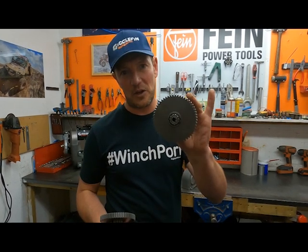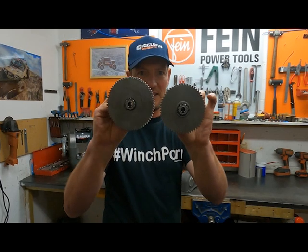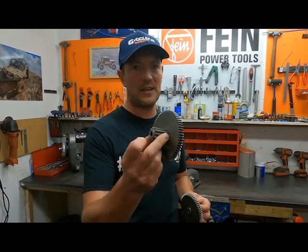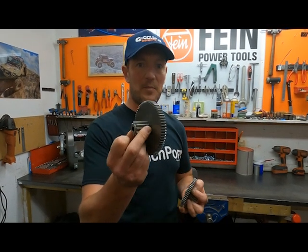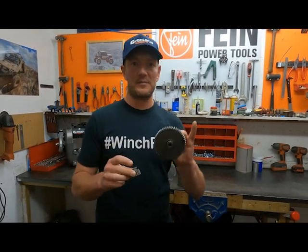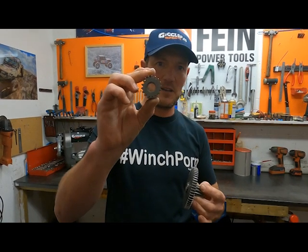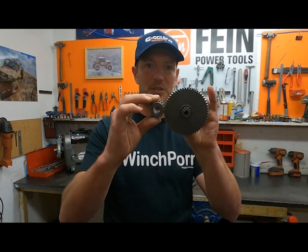We've also got this though, which is its bigger brother. This is the plus 15 version. So I don't even see there's a difference in sizes there. Now, the standard gear is available on its own, comes with the center pin, the bearings, all of the bits and pieces, and you can buy that singularly. But the plus 15, it comes as this gear with the pin, all the bits and pieces. Also comes with the pinion gear as well, because that needs to be different because obviously the teeth won't mesh.